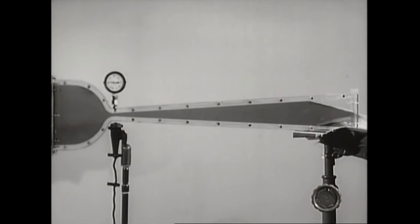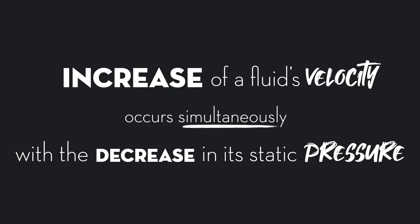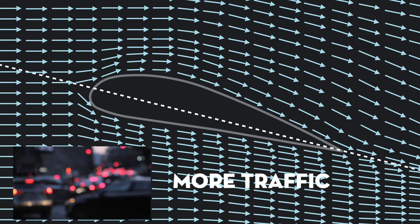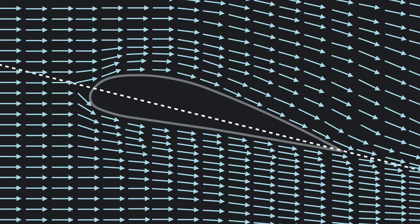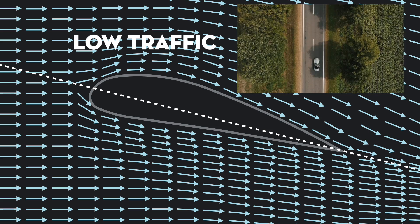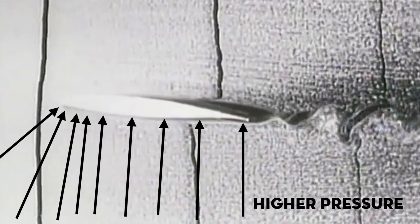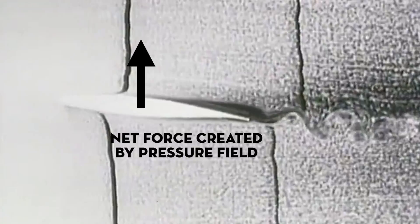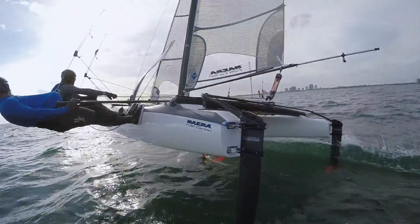This effect in fluids is so significant it has a special name — it's called Bernoulli's principle, named after the Swiss mathematician and physicist Daniel Bernoulli. It states that an increase in the speed of a fluid occurs simultaneously with a decrease in static pressure. Putting all of these ideas together on a hydrofoil: the water that flows over the lower surface is like cars getting diverted downward — the resulting traffic jam creates low speeds, which in turn maintain high pressure. The water over the upper surface is like cars that suddenly have more lanes — they accelerate into the new space, which simultaneously reduces the pressure. These different molecular traffic patterns result in higher pressure on the lower side of the foil and lower pressure on the upper side. The difference in the two pressures results in an upward force that lifts a hydrofoil out of the water, which again reduces the hydrodynamic resistance by eliminating waves and reducing wetted surface, allowing the craft to accelerate faster and faster.